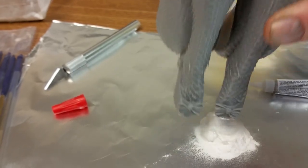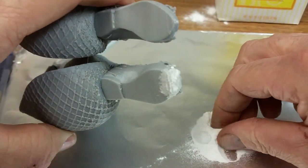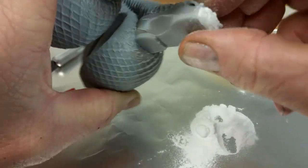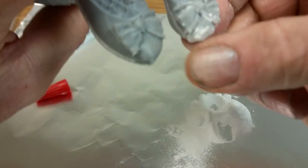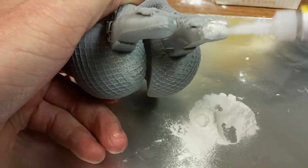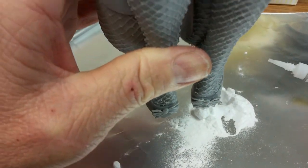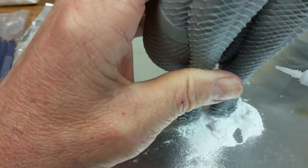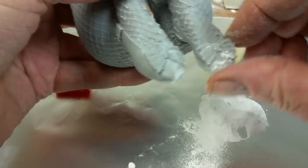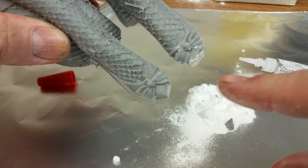This camera doesn't like this aluminum foil surface. On our first application we've sealed up the toe — you remember there were all those curled lines in there from printing. We're going to apply some more glue and do the same thing again. There's a reaction between the crazy glue and the baking soda which makes it harden instantly. We got a little low spot there, but I'd say we're doing pretty good.